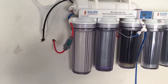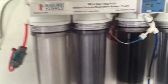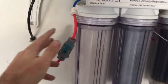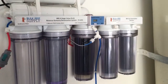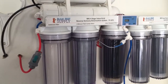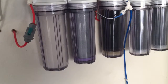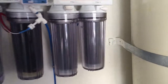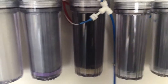I'm going to be turning off the water and draining the product line so that you don't squirt yourself with water, which is kind of a pain. As many of the push connect fittings as I can are going to have locks on them. I'm going to unmount this canister, start moving all the lines around and putting on the carbon filter, taking out the DI. I'm going to save this DI in a plastic bag so that I have a brand new DI, and then this used DI will be right here, and this will be carbon.